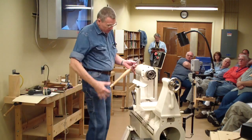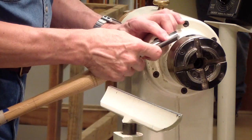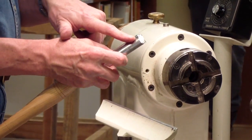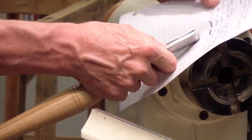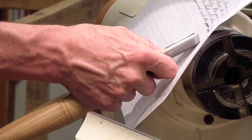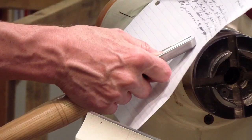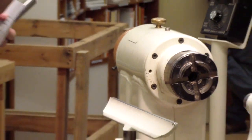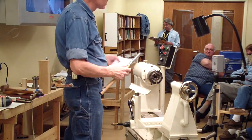You can adjust it — keep looking at it and see where you're at. You take a marker and put it on here, then go back and forth, and you'll see where you like it. Put a piece of paper on there, go back and forth, and it will start the paper directly under where you come back. Then you can come down, up, whichever way you want. Rotate the paper and you can kind of see where the pivot point is. If it's too high or too low, you can adjust it. Especially if you've got an older lathe against the wall — all the dust keeps going off. And with this way, it's fairly quick.